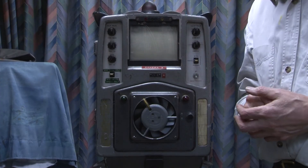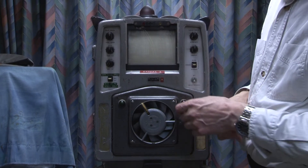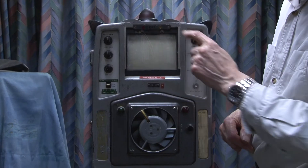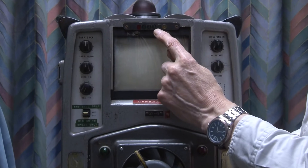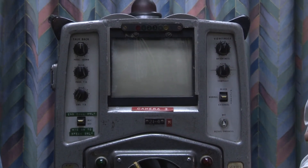This is a 7-inch viewfinder. It gave a very bright, sharp picture. One of the interesting features is this little row of illuminated indicators here. The red one is obvious — that's the cue light showing you're on air. But the green ones indicate which lens you've actually selected, as an aide-mémoire.